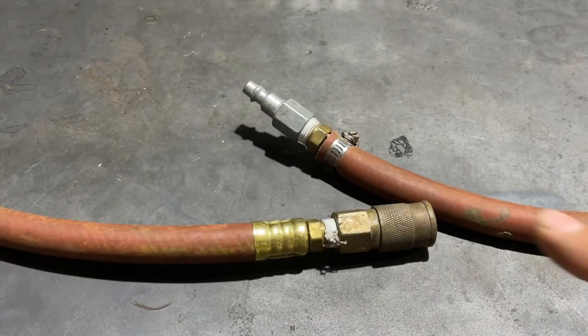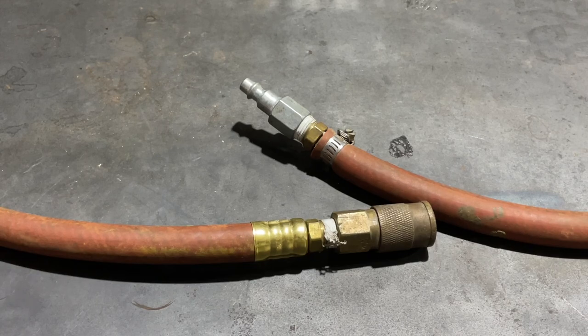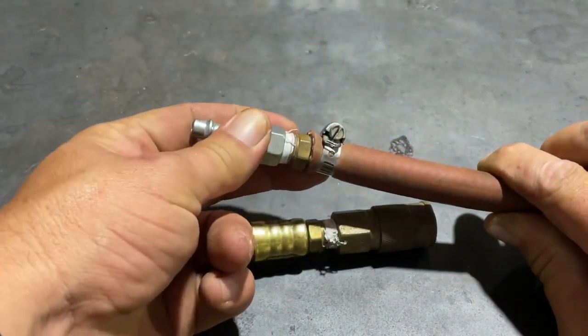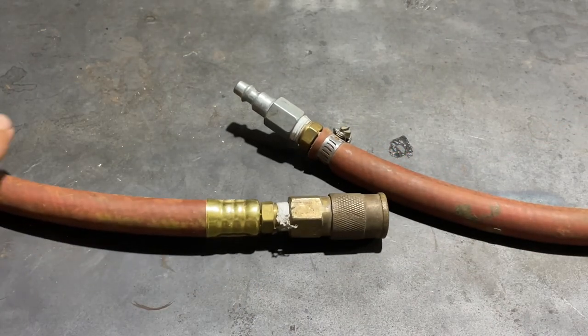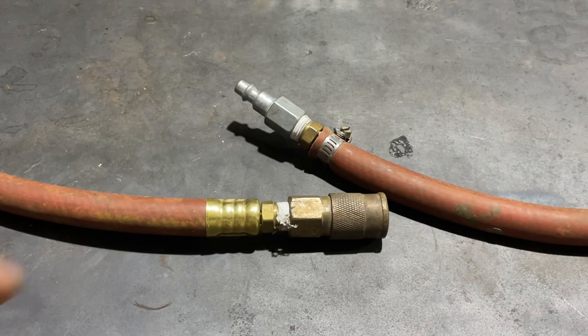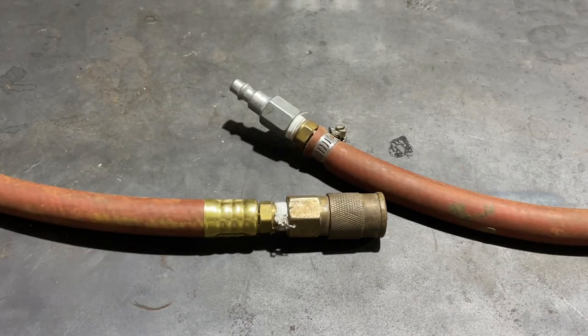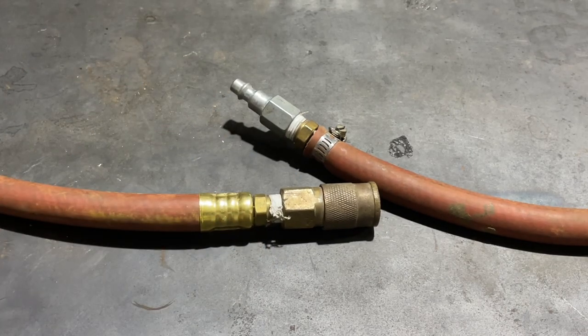Before I get started, I wanted to show you what I was working on. This is a 3/8 inch whip that we were using in the field. To put it together, we had to just use regular hose clamps. While that gets the job done, it's not the cleanest of looks. Whereas with the ferrule crimper and ferrule, it's a much cleaner job — you don't have all these sharp edges, especially along that screw. When you're pulling hoses all over the place, they get hung up on everything, so it's much better to keep it as smooth as possible.